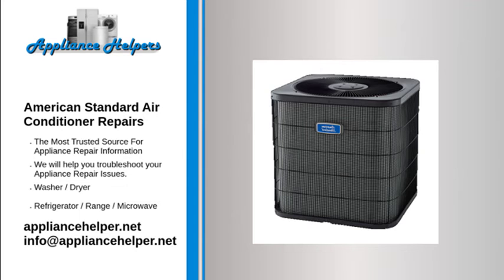No airflow. Check around your outdoor unit. If there are any leaves, hedges, or property walls butting up against it, your system may have frozen up due to a dirty coil. Make sure your outdoor unit has one foot of clearance all around it. Check the filters in each of your system components where applicable. If any of your filters are dirty, consult your manual to clean or replace it, or call your dealer to do this for you.